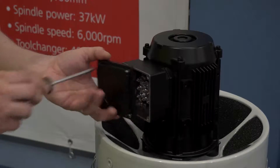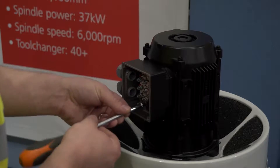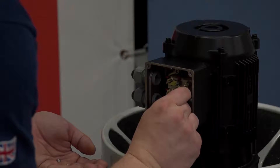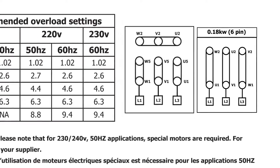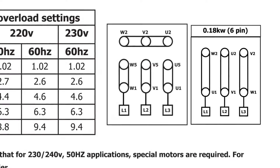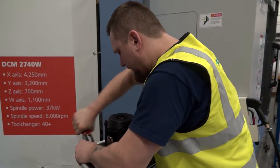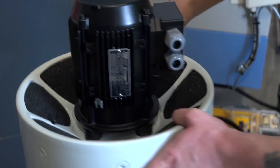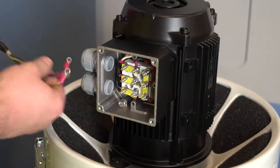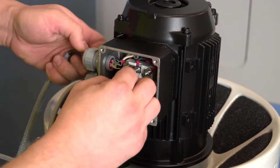Before mounting the unit, you will need to pre-wire the motor. Filter mist motors are wound for low and high voltage and operate on 50 Hz and 60 Hz, as shown in the table in the installation manual. A connection diagram can be found inside the motor terminal box. The motor must be connected via a three-phase direct online starter and isolator with suitable thermal overloads, or via an independent supply in the machine control panel.